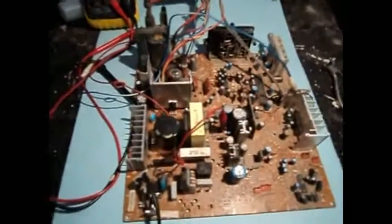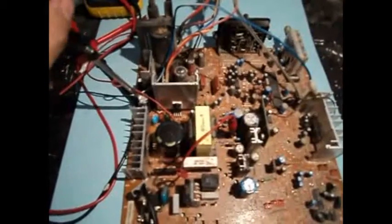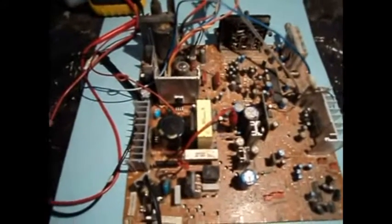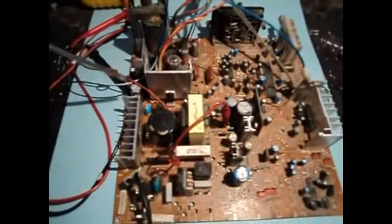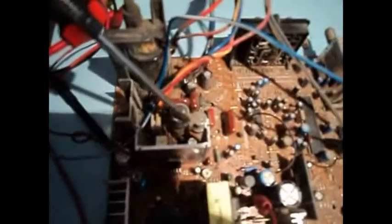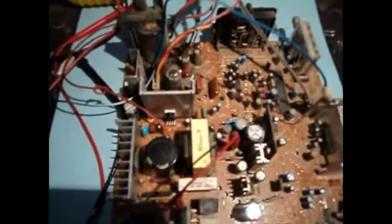I'm about to fire this thing up. I changed all the electronics directly related to the vertical output. The owner said there were gaps at the top and bottom before this thing blew up — that's a symptom of bad caps. The caps I replaced were: 2,200µF at 25V; 1µF at 50V; 100µF at 35V, although I replaced it with 100µF at 100V; and a 0.68µF at 50V, which is a weird value, but the junk chassis I measured the yoke on had the same exact cap in there.